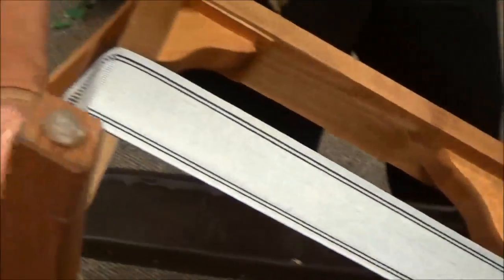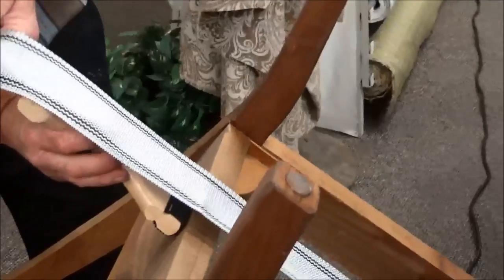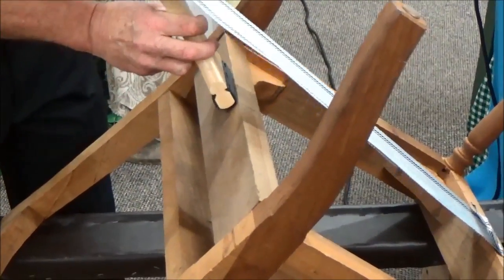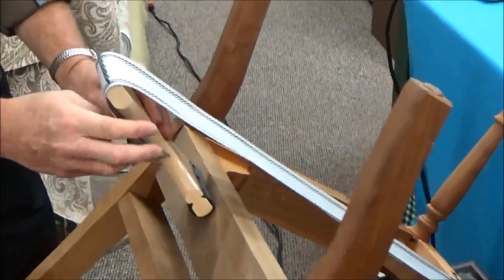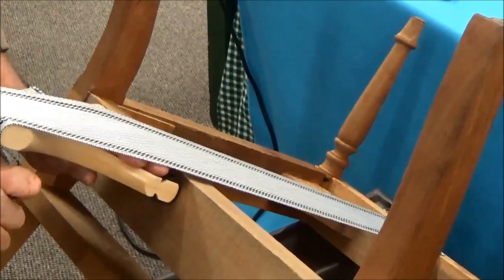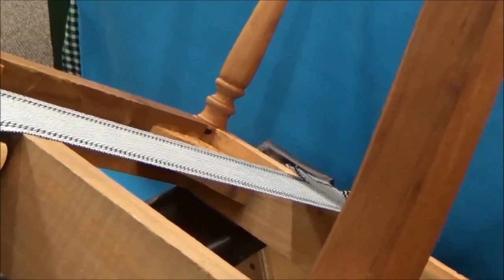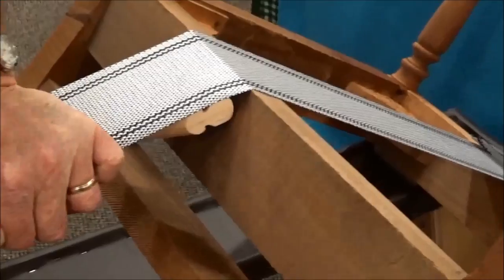Now we want to stretch it to the other side. I'm not going to be able to get it too tight by hand, so I need a web stretcher. I'm going to use first the basic web stretcher. Because the basic web stretcher is kind of long, you need a good amount of webbing past it — so you get a little more waste. You're going to turn this up at a slight angle and poke those nails or spikes right through there. You have to play with it a little bit because sometimes you can get it too tight. I'm right-handed, so I will take my left hand and push down sturdily on the webbing — you can see it's getting very, very tight.